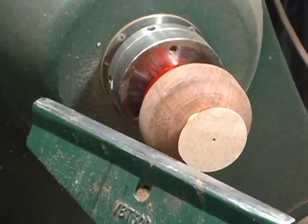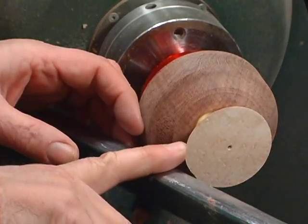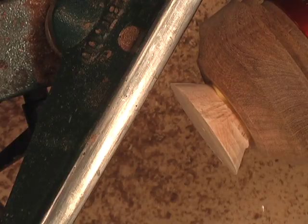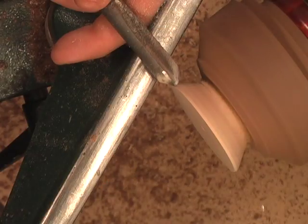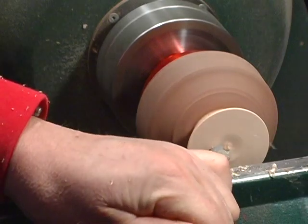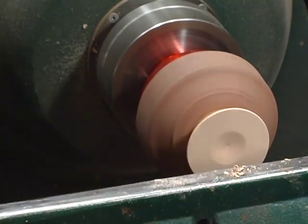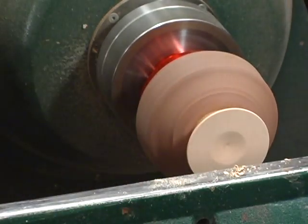I want to make this round. I want to true it up round so it's easier to eyeball fit it to the next component. And while I'm at it, I'll take a little wood out of the center. That'll make it easier to true up that surface, the flat horizontal surface going against the next ring. During these steps of truing up, be careful not to remove too much wood. Keep your options open. Only remove what you know you will not need later on.